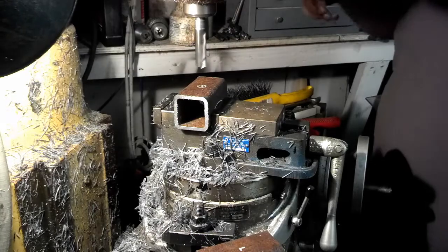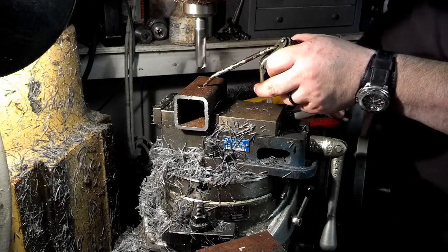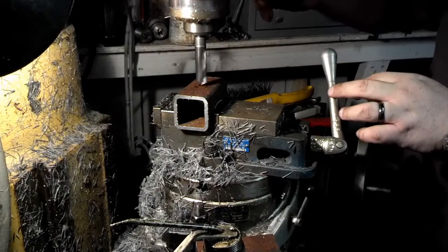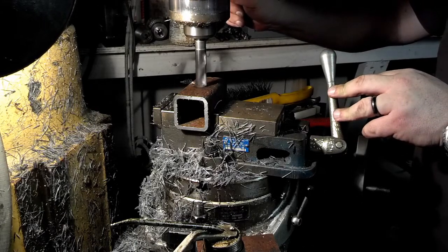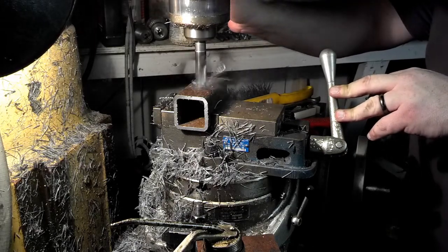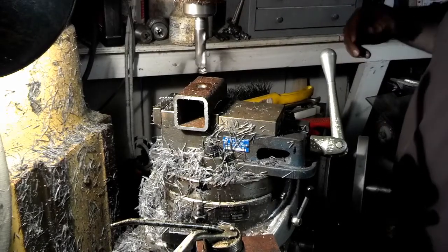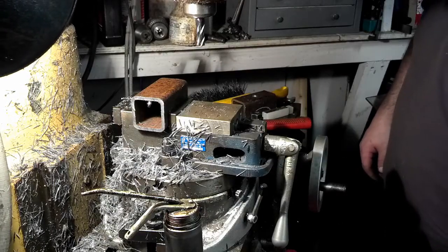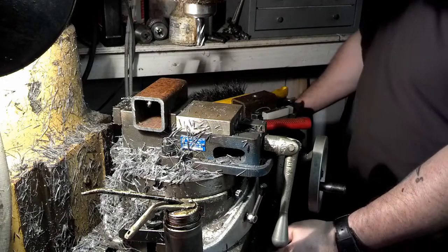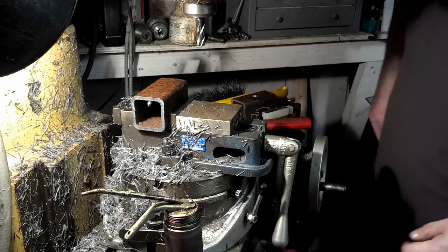And I'm going to slow this down to about 500 RPM. Throw a little oil on it. Okay. Make sure this is clamped down tight. Come down here. And this is just a 21/32 drill with a 1/2 inch shank, just Silver and Deming, held in a 1/2 inch collet. Yep, piece of cake. Okay. We're at 125 negative on the Y. I'm going to get my X a little closer here. Okay, reading 2/10 on the indicator on X.